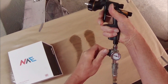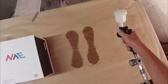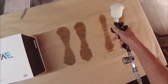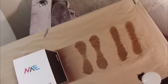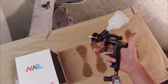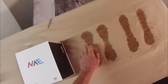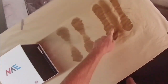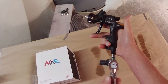Now I'm doing it quickly because it's thinners and it will disappear fast. I'll get the original on and set it to the same, about 1.4 bar. You can see it's starting to separate so I'll bring the pressure down slightly. The pattern is more or less the same — the pattern's slightly bigger on the original, probably due to the air holes, but it's not a dissimilar pattern. Don't worry about the lack of material in the middle; if you bring the pressure down it gets just as wet in the middle as at the top and bottom. Okay guys, hope you enjoyed the video — cheers, bye!